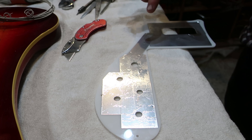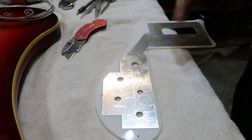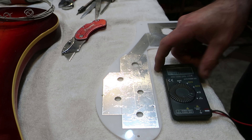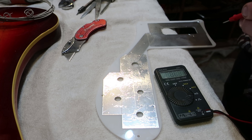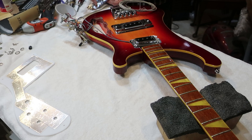I'd like to dispel a little myth, if I may. The myth is that when you're shielding something you need to fold over the edges of the tape so it will stick down and make proper contact. The fact is there's so much surface area it's making enough contact — it is forming that Faraday cage through the adhesive even. Here is a little continuity tester, and here is the continuity between two pieces of tape that were not folded over at each end. There you go.